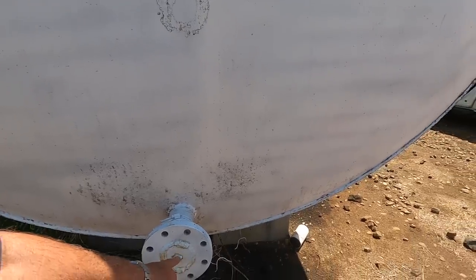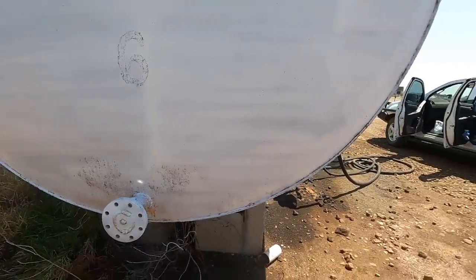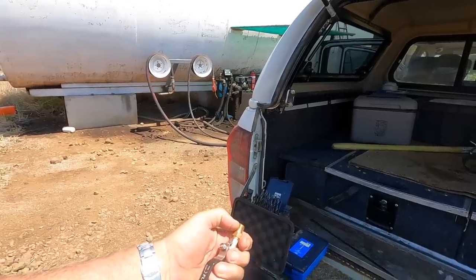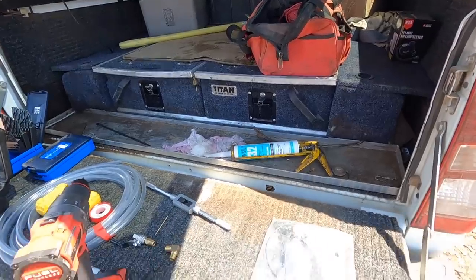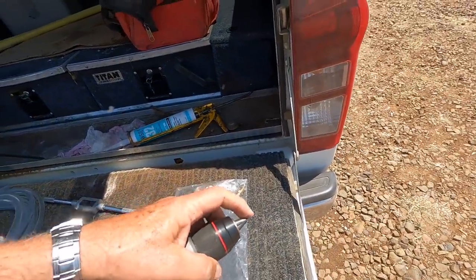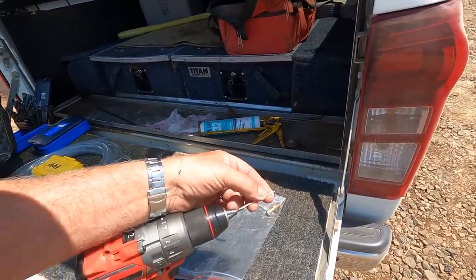The plan is to drill a little hole — I'll use a really tiny little drill, make a pilot hole, see how deep or how thick that metal is, and whether there's enough to put a bigger drill bit in to give me enough threads to make it seal. I've got a redundancy plan here — a toothpick to plug it — so even if I drill right through, it won't matter. The drill bit can chew out the toothpick and that won't cause any drama whatsoever.